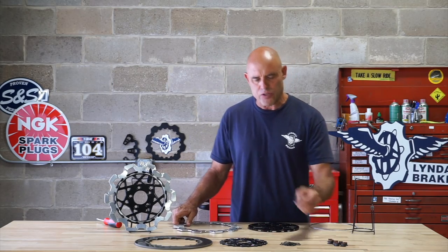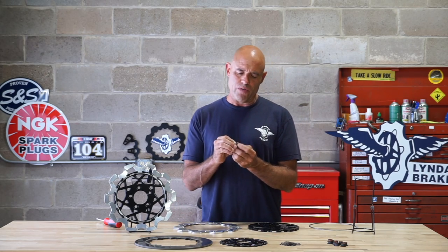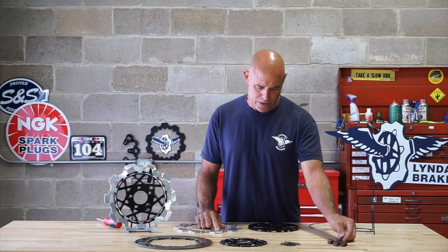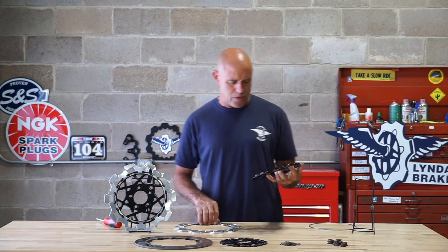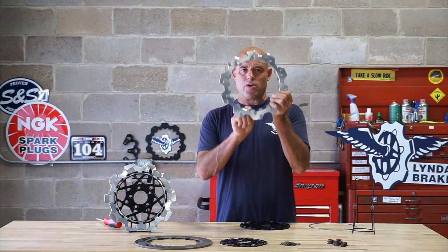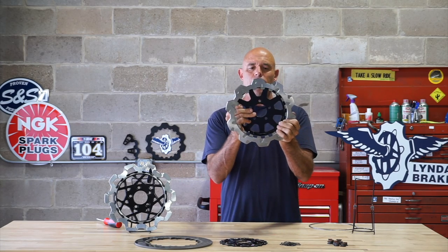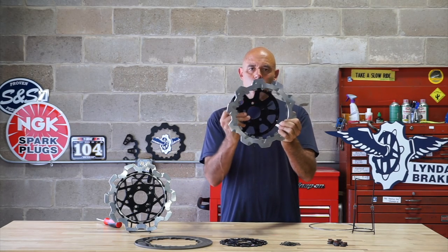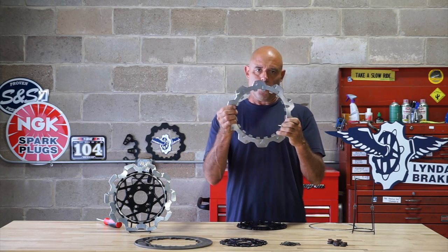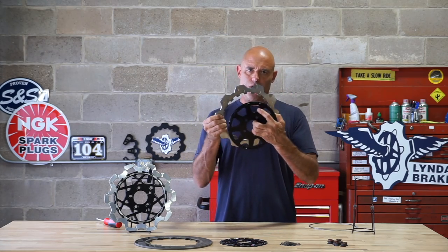Oftentimes, a button style rotor, in our experience, would have a lower service life. It would get rattly, it would get loose quite fast as compared to a lug drive floating mechanism. And the reason why is, much like a clutch basket, these 90 degree engagements are an abutment to the shear load, because the shear load goes through these two components at 45 degrees. So having a 90 degree abutment is what reduces the amount of backlash between the friction ring and the carrier